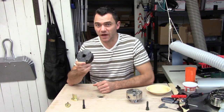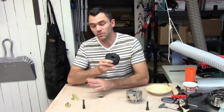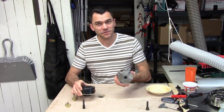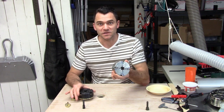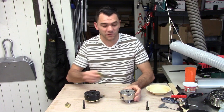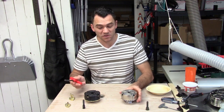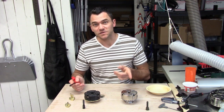I started out with the Bulldog and I've had it for about a year. I've built up a small collection of jaws for it, both from Bulldog and from Bicmark. I decided to get a second chuck body just to cut down on jaw changes, and with that decision I went with the original recipe. The most important question is: are the jaws interchangeable? Yes they are — any Bulldog jaws work fine on the Bicmark and vice versa. Furthermore, the chuck key is the same, an 8mm hex wrench, so it really is like having two of the same chuck. But there are some minor differences, so let's zoom in and take a look.